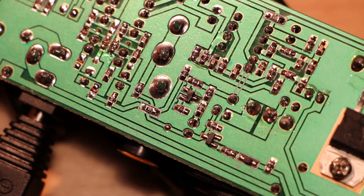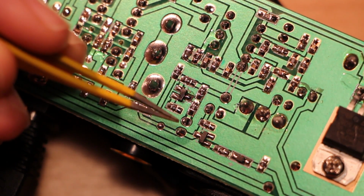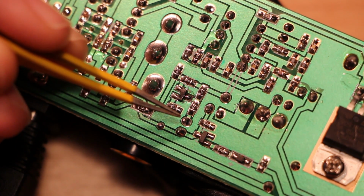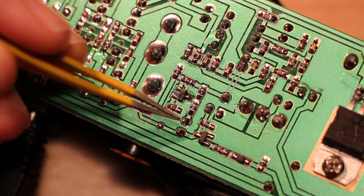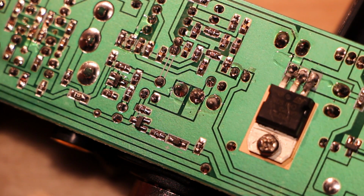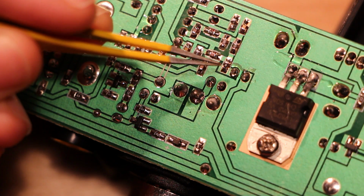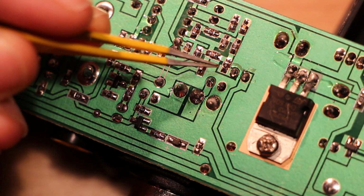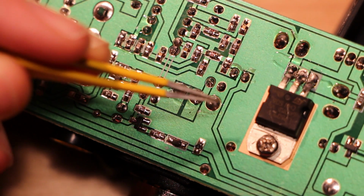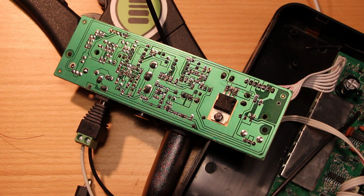So I think on the output side, we want to go in right around here, probably kind of displace this resistor a little bit, and solder a wire to that capacitor leg. And then on the input side, since we've already got that capacitive coupling, we can just bump off that 0 ohm resistor just to make sure this isn't coupling noise back into the input, and then tack on a wire right there. Is this it?